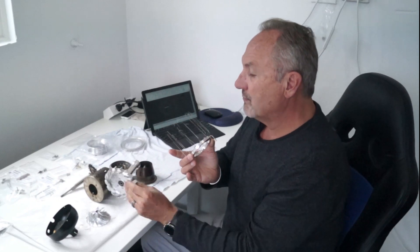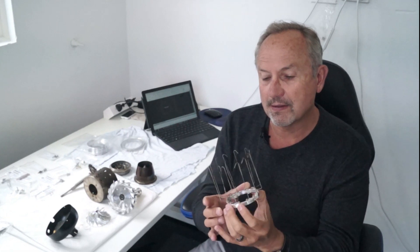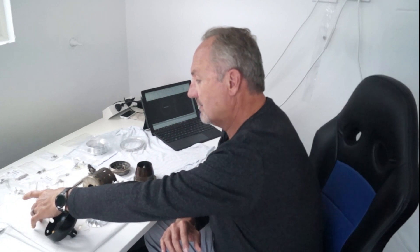We can protect and reuse this part by sealing it from the fuel, which we'll do. So we'll redesign this fuel ring for two things: one is to separate the lubrication flow from the fuel flow, and secondly to make it stainless steel. We're in the process of drawing that up, and once we've drawn it up we'll send it to the machinist to machine it for us, and we'll reassemble the stainless steel part into the engine to make it work without corroding during testing.